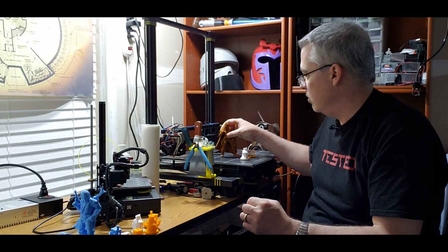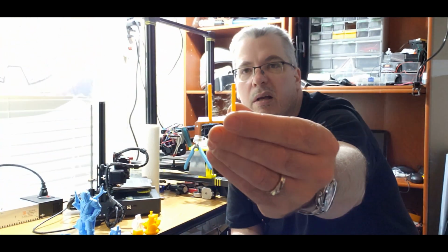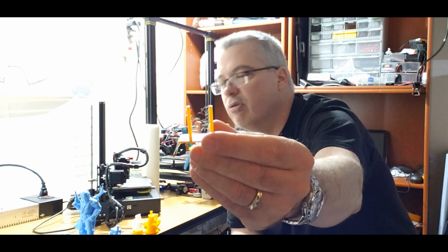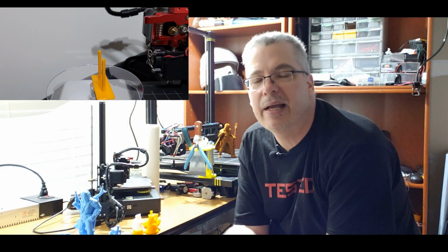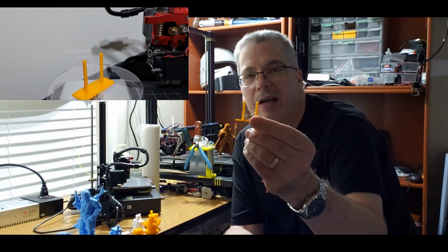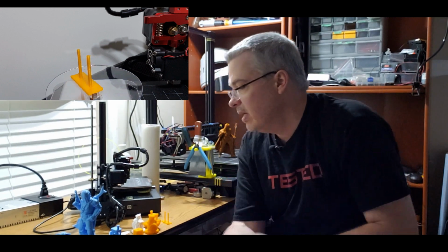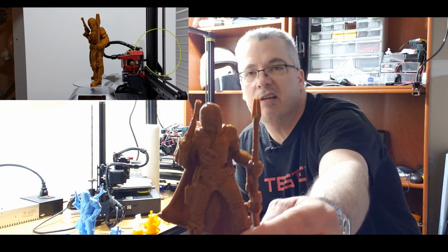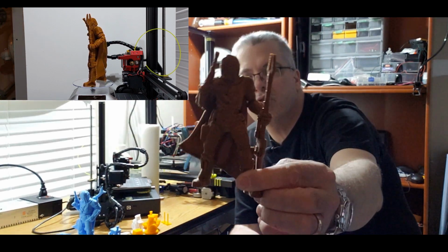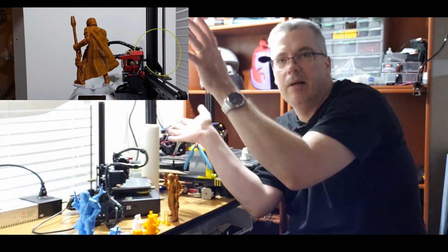And I decided to do the retraction test. Straight with the slicer, I found it actually prints a little hot. I ended up printing this at 175, and it looks really good. There's just a slight amount of stringing. Then I did Big Boy Mando over here, and I tried some different filaments and stuff like that, and he came out pretty good. Again, I'll show you all these close-ups. They're probably going on in this area over here right now.